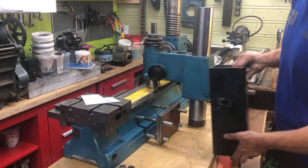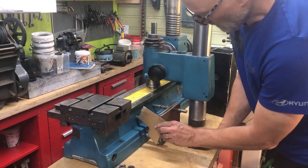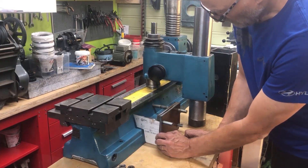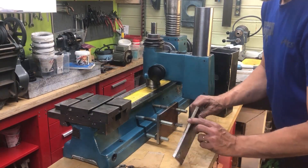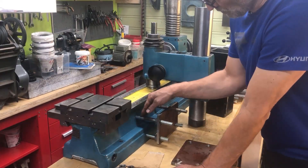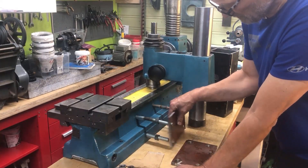This is how it looks when assembled with the column on top. The plates aren't supposed to be standalone — to mimic a cast iron bed, I want to fill this void with epoxy granite again, with the ribbing and a bit more metal structure in there. Then I weld the loose plate onto the square tubing, accurate to the bolster.